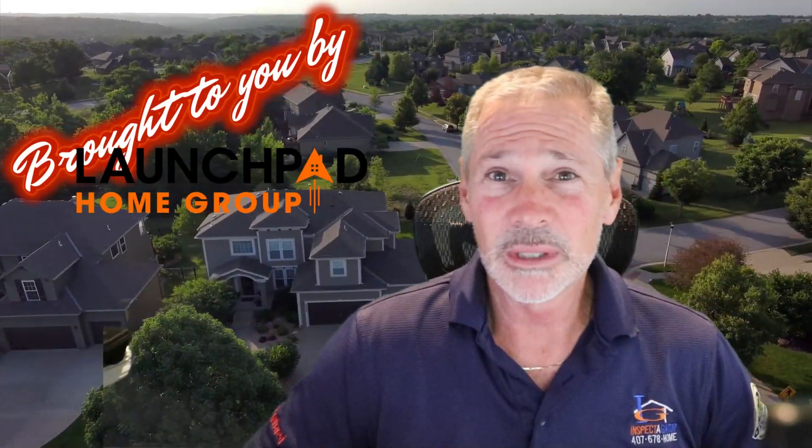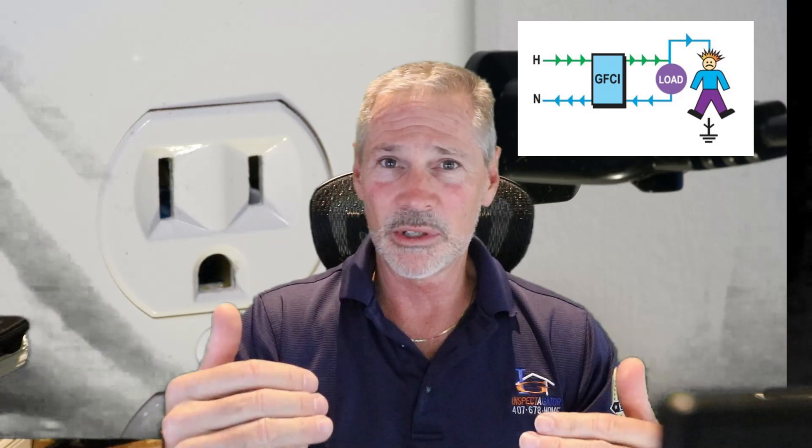So what does GFCI stand for and what does it do? It's actually pretty simple. GFCI stands for ground fault circuit interrupter. Its whole job is to measure the current that comes into the receptacle and the current that goes back to the breaker. If there is an imbalance — say a child sticks a coat hanger or a fork into the receptacle — that bleeds off some current and creates an imbalance. The GFCI almost instantaneously opens the circuit, protecting the child that stuck the metal thing in there.